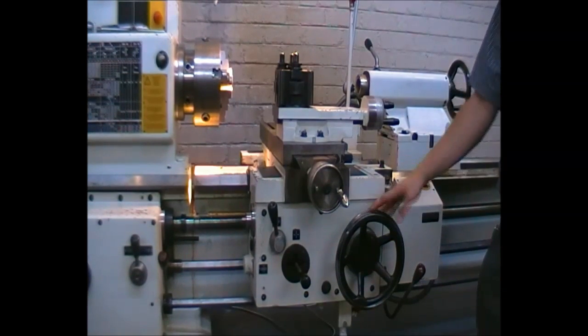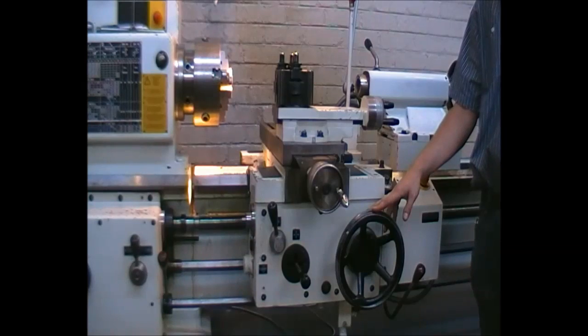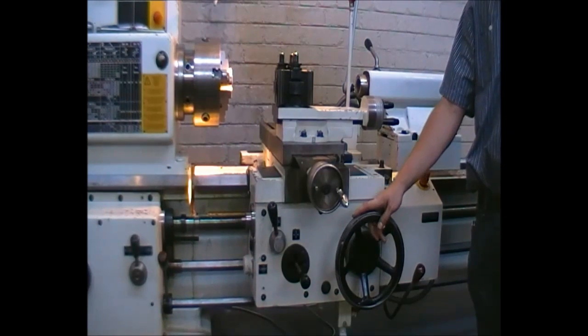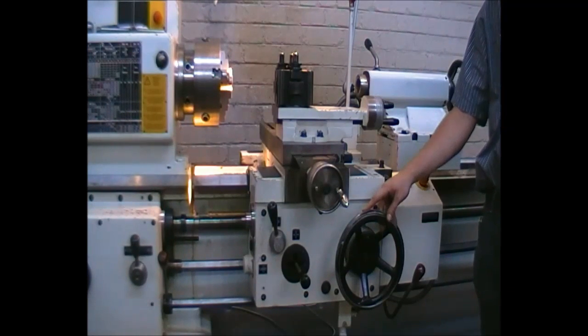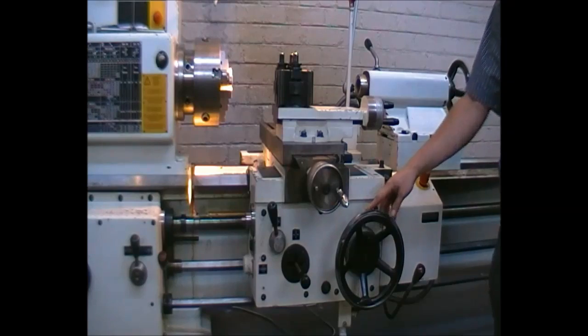Please note all our machines are equipped with automatic feeds. Automatic feeding ensures a cleaner surface finish, more accurate than by hand. At the beginning of the day you move at 20 millimeters a minute; at the end of the day you may want 50 millimeters per minute to get your project done. This is easier and more controlled with automatic feed.